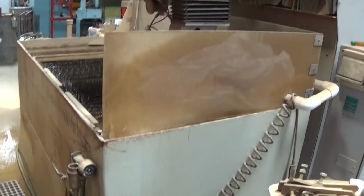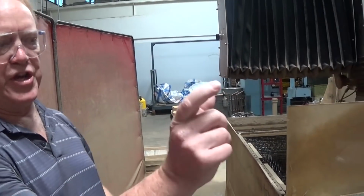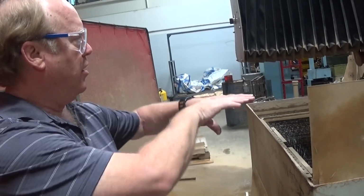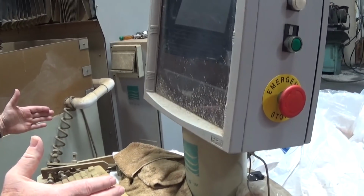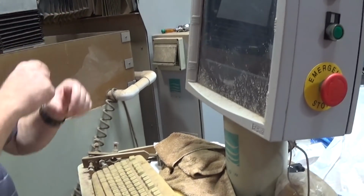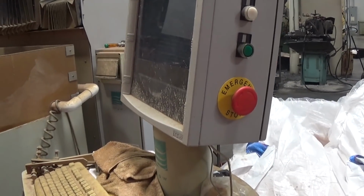This is our water jet, our high pressure water jet cutter. Yeah. Uses 56,000 psi to cut the material. You can cut steel up to 3/8 of an inch thick. Yep. When they have a program running, there'll be a single item that they'll have here, but then the program will step and repeat that across the sheet. So the item is programmed in, and then they tell it how big the sheet of material is. Yep. And then they'll let the program do its step and repeat. In some cases, because they're weird shaped, they'll get nested along the way to get the best yield. And then it's dirty or muddy because we use powdered garnet as an abrasive to help the cutting process.